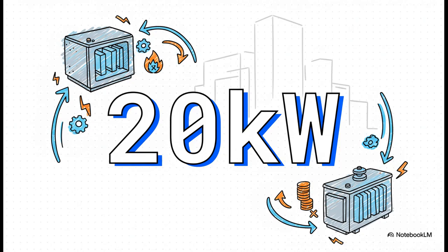And here's exactly why we're so obsessed with location and ventilation. A single 1600 kVA transformer running at full blast is kicking out over 20 kilowatts of waste heat. To put that in perspective, that's like running more than a dozen high-powered space heaters in a tiny room 24/7. If you don't get that heat out, you are literally cooking the transformer and drastically shortening its life.